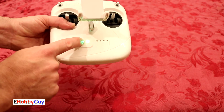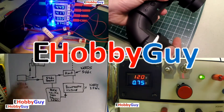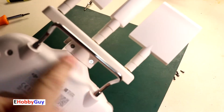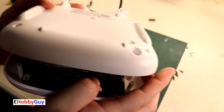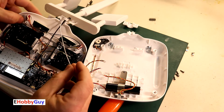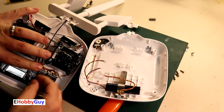Let's see if we can figure out a fix and jump right in. To get this open there are four screws in the back to take out, along with two nuts and bolts that hold the antenna assembly onto the main housing. They were pretty quick and easy to remove. I pulled it apart making sure to start from the base, because the antenna bracket holds the top together — so you have to pull it apart at the bottom and then pull the top half out from the antenna bracket.